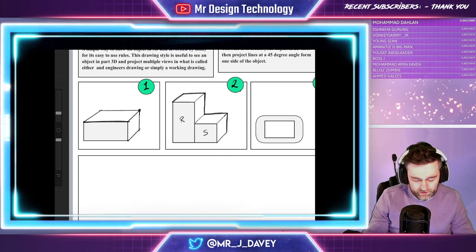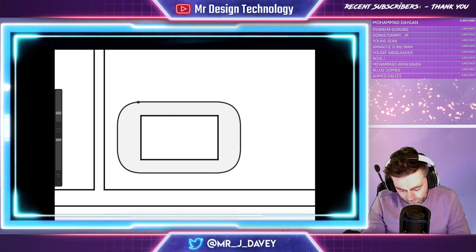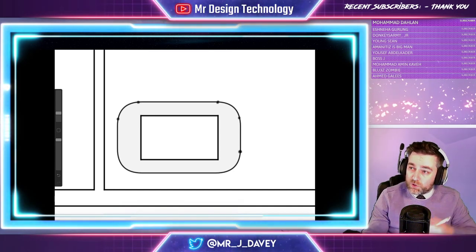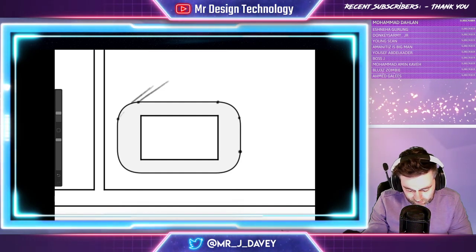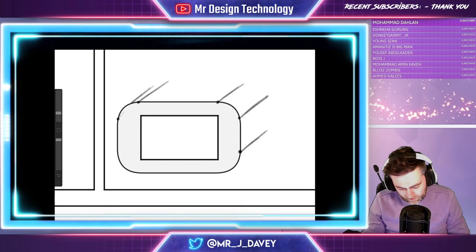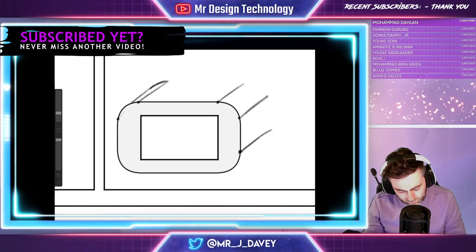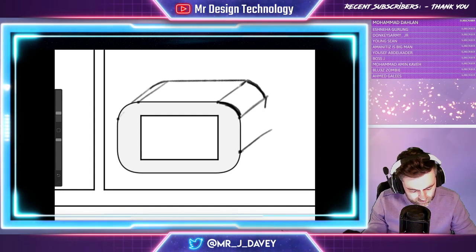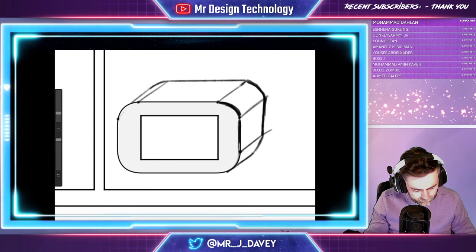You might be thinking — that's great, but how do you handle curves? Well, it gets a little bit more tricky. From here and here, and from there and there, is basically where my lines stop being straight and start to curve. I'll pull that off at 45 degrees like that, then pull that across, pull that across, pull that across. Then I'm going to try and copy this curve here onto the projection — that should then be a straight line — then copy this curve, which should be a vertical line, and then copy this last curve again.